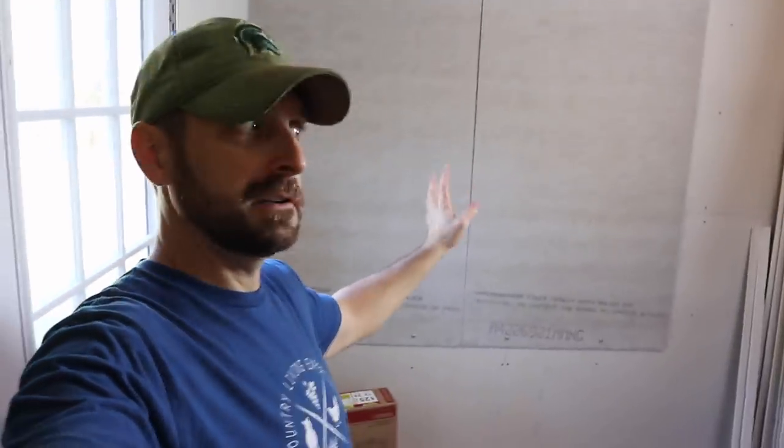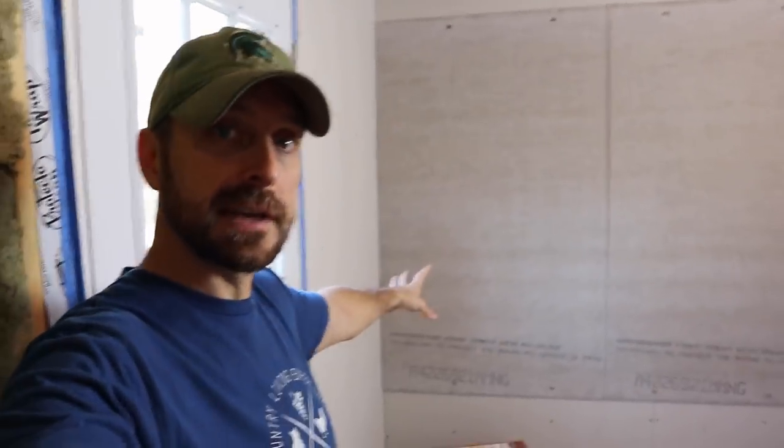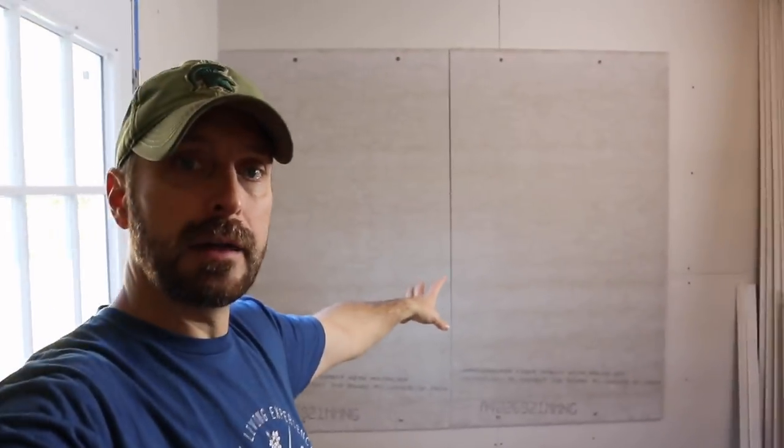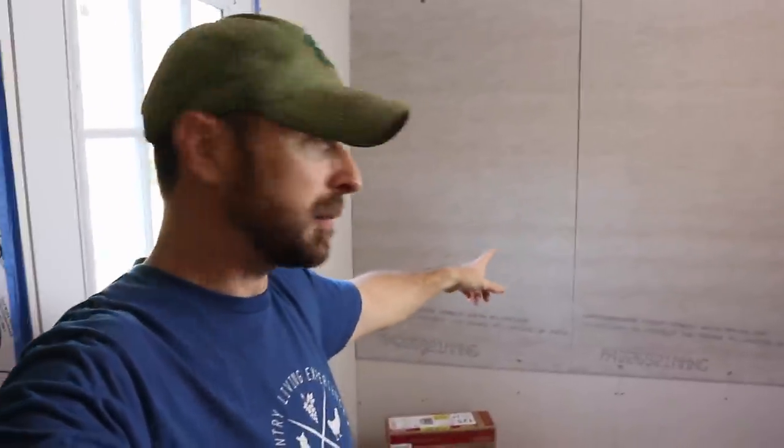Although all those solar components we are putting in there are not taking up that much space at all, which is really cool. So in this room, which is roughly 9.5 by 11.5, we've got just this corner dedicated. We've got some Hardie Backer on the wall for fire safety, and it's recommended that you have that up on the wall.